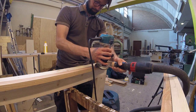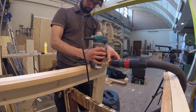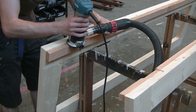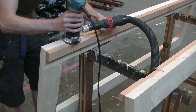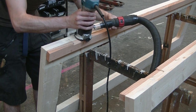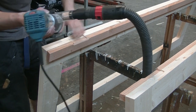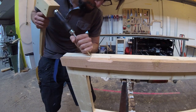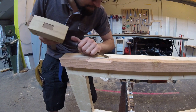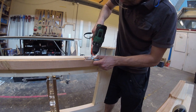First the chamfer for clearing around the hinge area was milled. This door is thicker than usual so an extra clearance needs to be cut. The second step is creating the pocket for the hinges — first with the router and then with the chisel. Then the hinges are nice and snug, the holes are drilled and I can focus on the pocket for the lock.